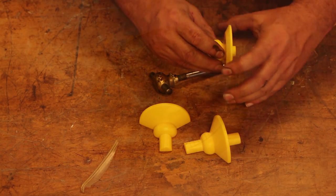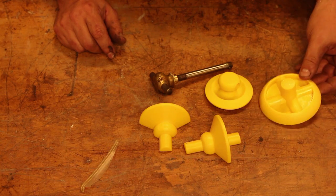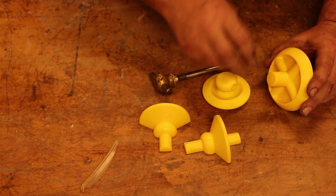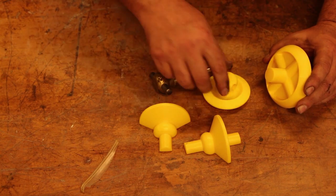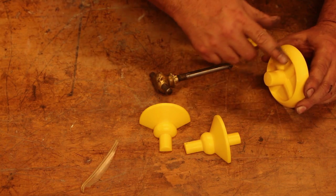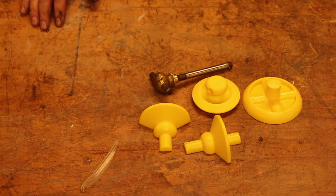Additionally, we needed the little piece that this dial goes into. There's another plate behind it, the back plate that you read it on. And again, we created a pattern right here that will be machined out of. And basically, again, we've got some pieces here to hold it in the lathe to make it a little bit easier. But all this metal in the middle will actually be machined out, and this dial will fit down inside of this very nicely. And this is what will have the line on it that you read the dial as you're turning.